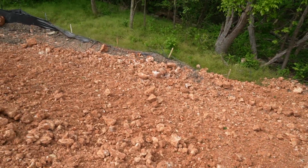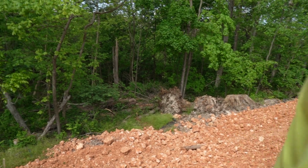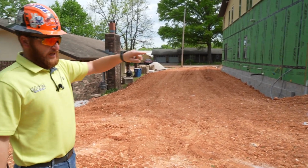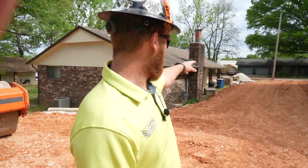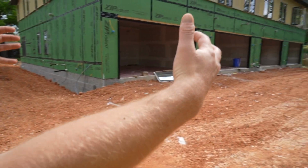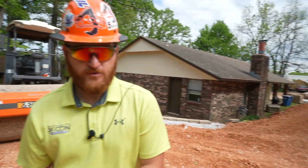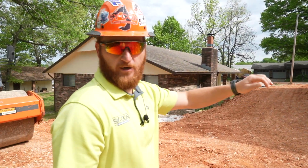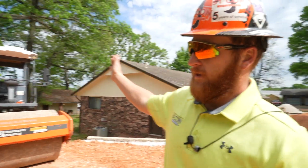There's another wall going back here. You can see we've tapered off the fill for now. There's another wall getting established, basically tying this point in. We've got a box. I know you guys keep hearing me say box, box, box, but we've been using that power pole as reference, that black 42-inch plastic pipe that Bill's moving from down the road. We're gonna basically build a box right here, catch all the water that's gonna drain on top of here in this box. Big pipe that takes a 42-inch all the way to 2 more boxes up there, which change the direction and make it hit all the way down to where we just came from at the outfall structure.